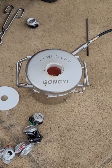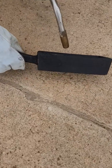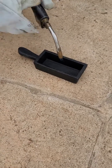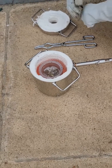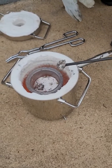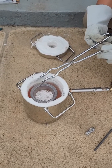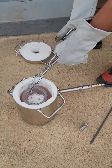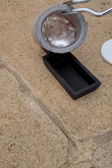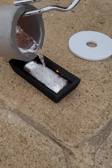Make sure anything you put in has no water inside — it can explode. Put your protective sleeves on. Heat up your ingot casting mold and remove any debris — leftover paint or dirt — so you leave the metal as pure as possible. When you cast your ingot or mold, you want the cleanest metal possible. Be careful when pouring — keep your ingot casting mold as close as possible so you don't have a time delay.